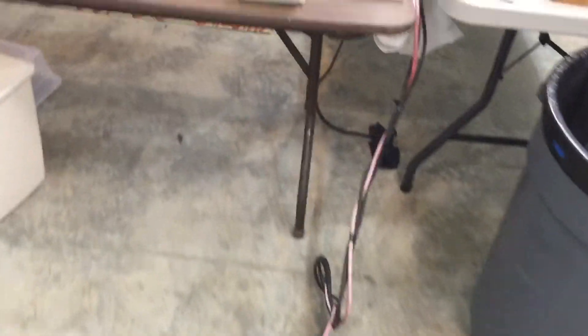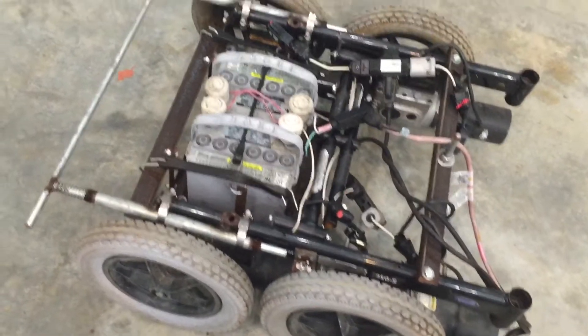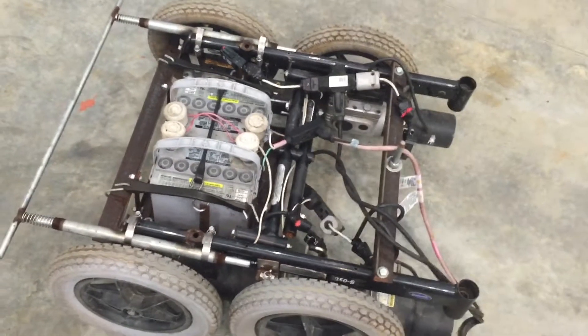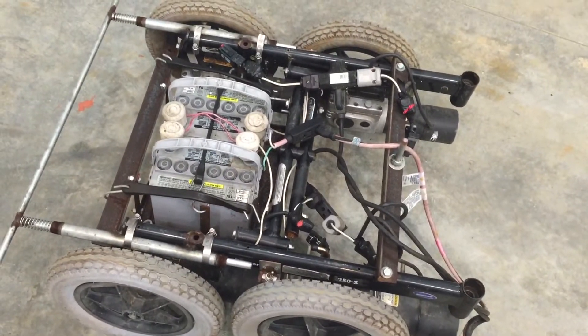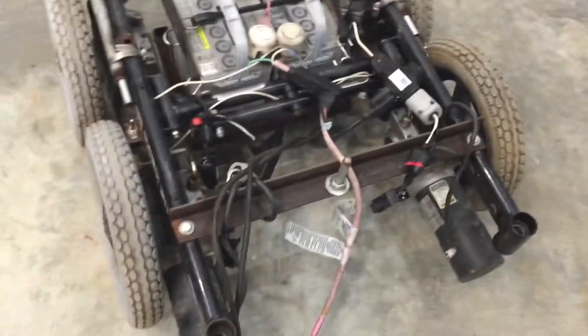These switches over here — it works very well. These motors were originally designed to run on 24 volts, with two 12-volt batteries in series, with a way to reduce the voltage through a joystick like the original wheelchairs had. It would run too fast — unsafe, hard to handle. So what I did is I just wired the batteries in parallel to give me 12 volts, and that keeps it at a decent speed. I like the way it operates now. It would probably be a good idea to put a bumper switch on the back too, because it runs backwards just like it does forwards.